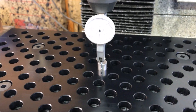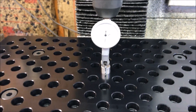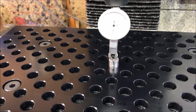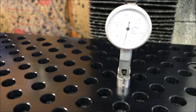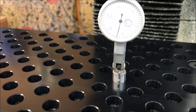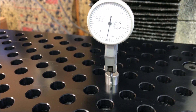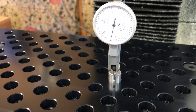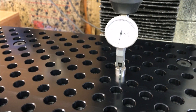Back over here I'm at about nearly six and a half thousandths, so I'm kind of splitting hairs here now. I'll go one more time and see if I can get it right on. When I came back over and double checked to make sure I was right in the middle of this dowel pin, it looks like I'm actually at just under six and a half — basically right there within tenths. I'm going to call that good, tighten it down and double check to make sure it hasn't moved.